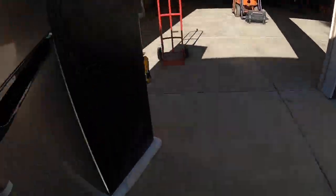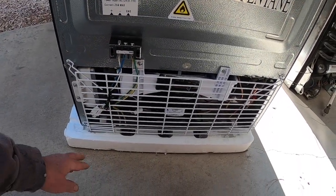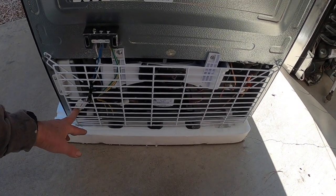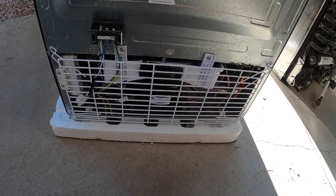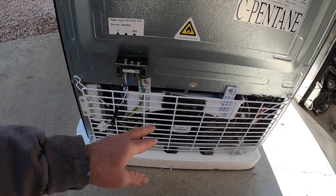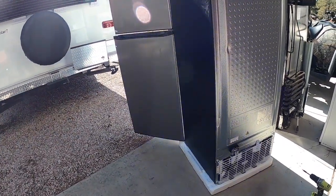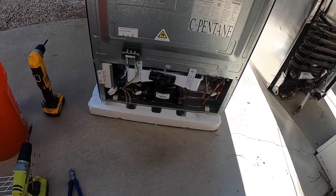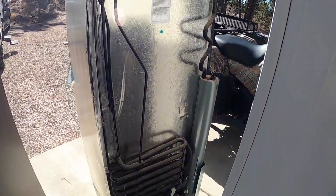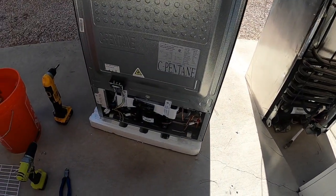The next thing to do is take off the grid on the back, and then I need to drill two holes down into the support bracket across the bottom. I'm going to use a 5/16-inch lag bolt into my three-quarter-inch plywood deck — that'll hold it and that'll be good. Then after that, positive and negative 12-volt DC, and I already have those wires; I'll just make a pigtail onto what I have and I'm ready to go. Here's what it looks like in the back of the new refrigerator — that's the compressor. That's absorption with an open flame in it — all this contraption with ammonia and water and all kinds of stuff. Absorption: open flame. Compressor: 12-volt DC.